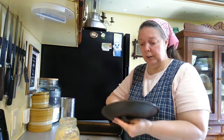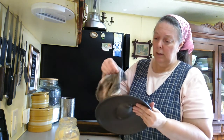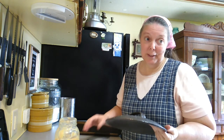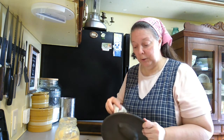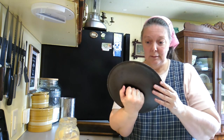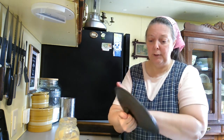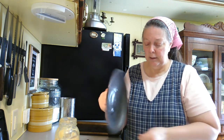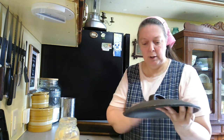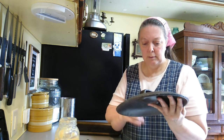And I got a thin coat on it. I think I'm going to go over it and just kind of... Now, I'm doing something I shouldn't. It's only because I don't have any lint-free towels, but it'll be all right. It'll brush off. I'm using a rag to put on the oil. It can leave little fibers behind, but it's not going to really make a big difference. I kind of just take my hands over it, wipe off the excess little hairs, and they come right off. There we go.